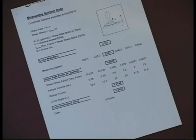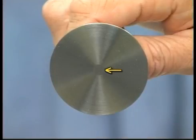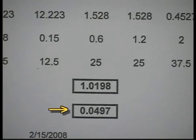The cone you ordered with your instrument will come with a data sheet. This data sheet will state the cone number, measuring system, shear rate and shear stress factor, and the cone truncation in millimeters. The cone truncation takes into account the tip of the cone being removed to avoid contact and friction with the bottom plate. We will use the cone truncation value to set the correct gap.